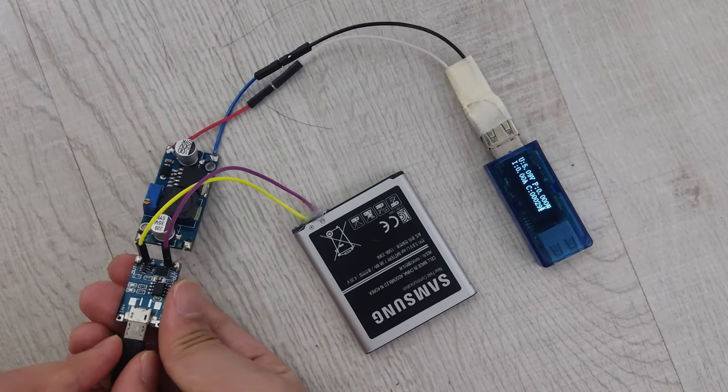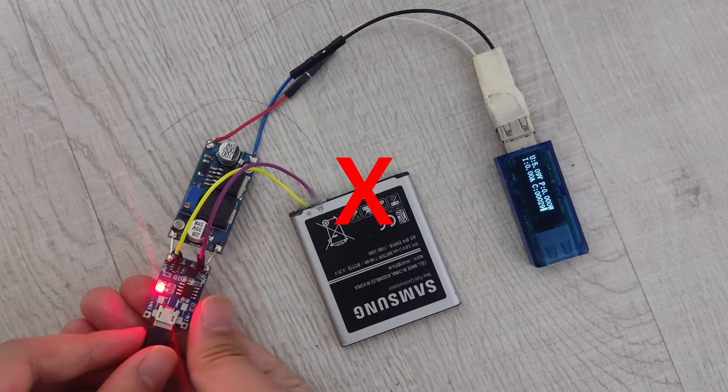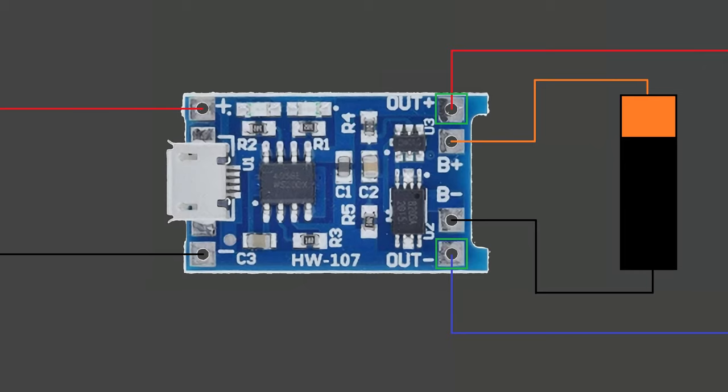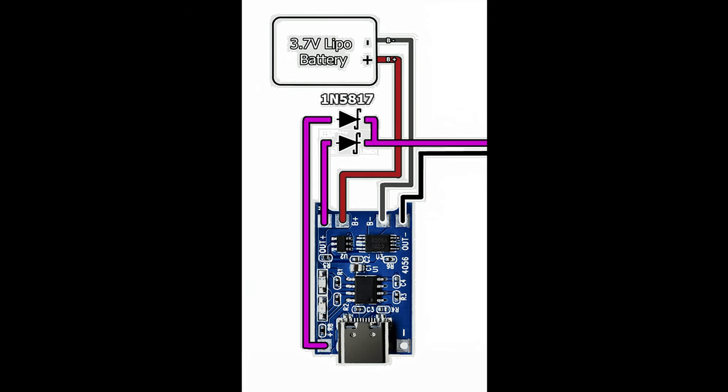You may think it is safe to use this board in all situations, but it has one critical issue: you can't charge the battery while discharging it. The reason is that TP4056 stops charging when it detects the charge rate falls below 130mA. If you have a load connected to the battery, this will affect the detected current so that TP4056 may never terminate the charging process. An easy solution is adding two Schottky diodes at the IN-plus terminal and OUT-plus terminal, so you can draw current from the power input instead of from the battery.